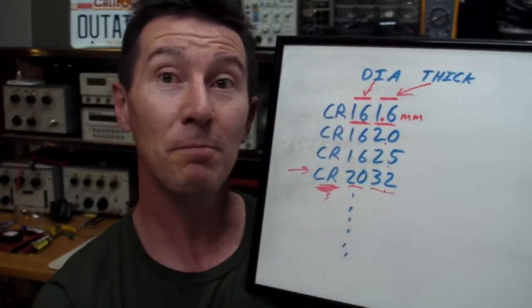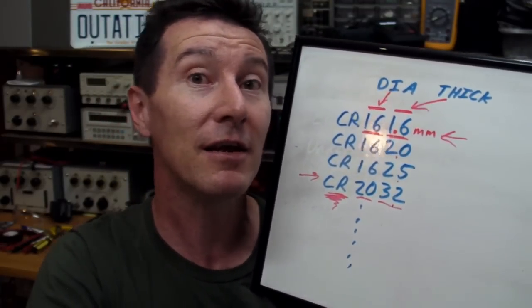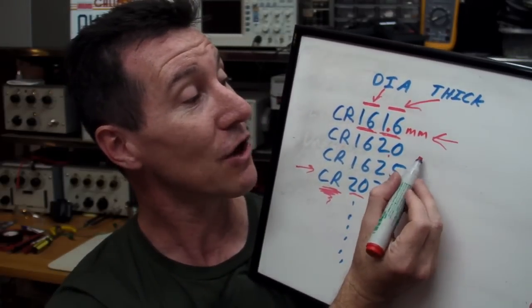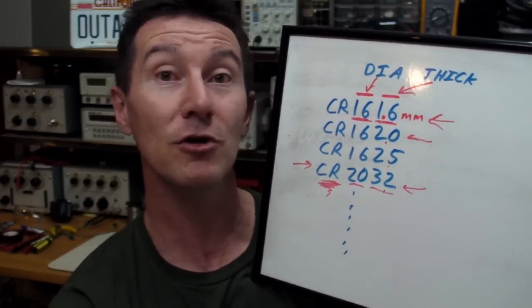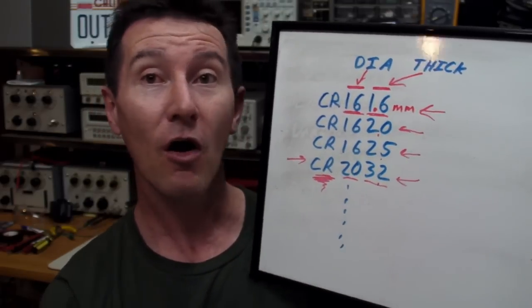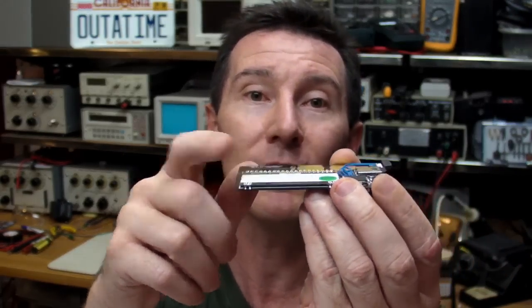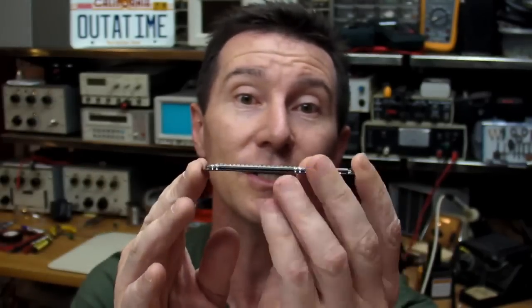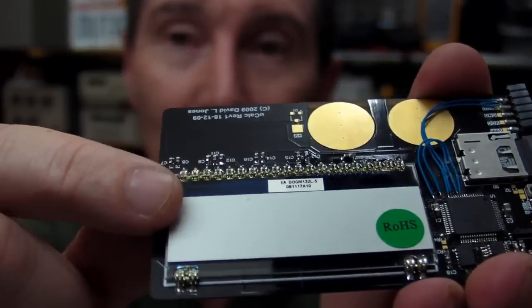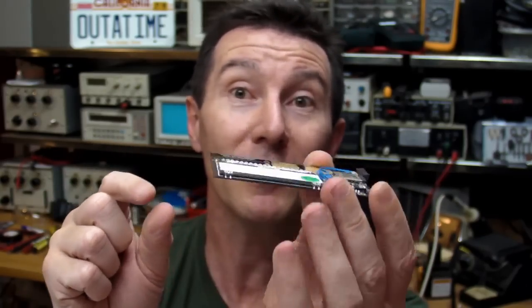If you give this a moment's thought — 1.6 millimetres is the thickness of a standard FR4 PCB. That's important. You can also get 2mm PCBs, 3.2mm PCBs, and probably 2.5mm — different thicknesses of FR4 material. The reason that is important is because when you're designing something really thin, ultra-thin like this, you want to make it as thin as possible. As it turns out, the maximum thickness component in my entire design — after a lot of searching — is the LCD, which is basically 2mm thick.